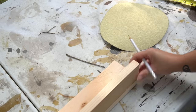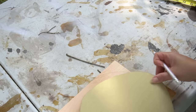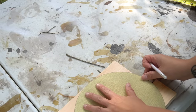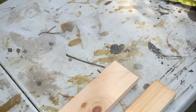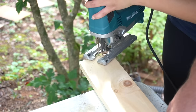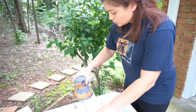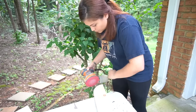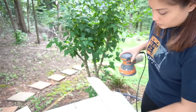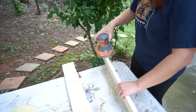There was a second thing where I deviated from the plans: I didn't want a sharp edge at the very top — I wanted to taper it. So I made sure to mark where the back support was going to be, and then with a sanding disc I traced the edge to cut that piece off and make it a little bit more rounded and custom at the top, using a jigsaw to cut this out. After all the pieces were cut, I gave everything a nice sanding to remove any splinters and even out the wood tones, since a few of the boards were a little older.